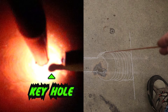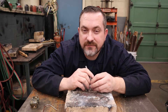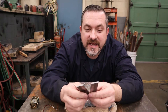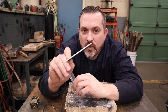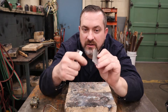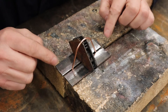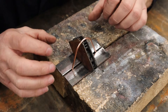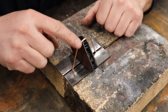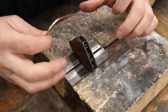If you haven't watched the safe setup and operation of oxy-acetylene gas welding, I'd highly recommend watching that first — link is above. I'm using the same sample material: one inch wide, one eighth inch thick hot rolled flat bar, with all mill scale cleaned off the edges and both sides on both pieces. To set up the gap, use a magnet to keep pieces flat while tack welding, then use a welding rod of the correct diameter as a spacer — it spaces the pieces out perfectly.